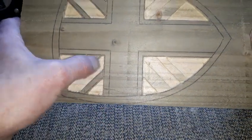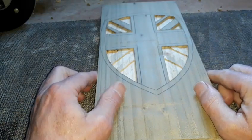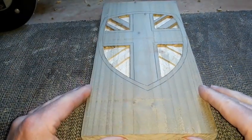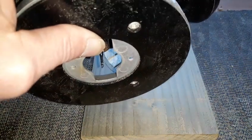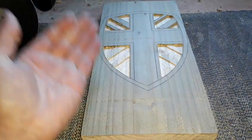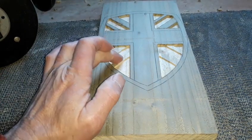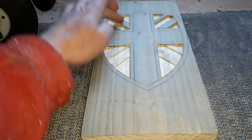I've gone around with the CNC bit and cut a line across all four sections. I've worked out that the millen bit that couldn't cut before was basically just worn away, so we've replaced it with a nice new one. Always keep an eye on your bits — a nice shiny new one in there. So we'll remove these two sections at the top, then raise it up again and do the next line. So far we've got level four done, level three, this will be number two, and number one is the final one.